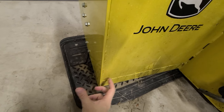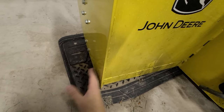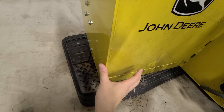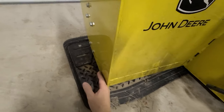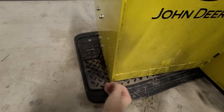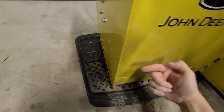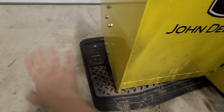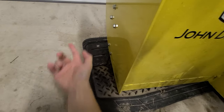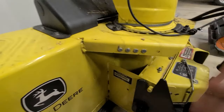Well, with that slop, that how many inches of slop that was back and forth, by the time you could feel it in the tractor, you had that whole snowblower jammed as far over that way as you could. Well, the problem is then you're going, and that snowblower has tension on it, pushing it this way. It wants to come back this way as you're going straight, and it'll pop over that edge and gouge out the grass. People don't like when you gouge out their grass.